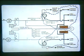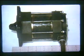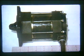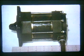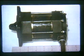Emergency alternator power can be read on the AC voltmeter when the selector is placed in the captain's or first officer's flight instrument position. The alternators provide AC power to operate the gyros in the flight instruments only. They are mounted on the inboard engines on the left-hand high-speed accessory section and are operating anytime the engine is running. The alternators are unregulated AC generators providing 115 volt AC three-phase 400 cycle power of approximately 100 volt amperes at 2,400 RPM plus or minus 100 RPM; at any other RPM, voltage and frequency will vary accordingly.